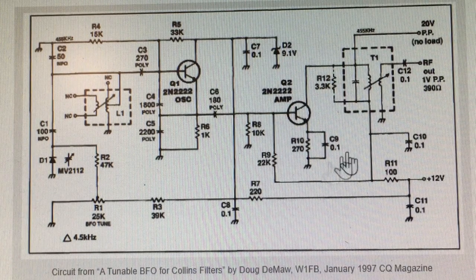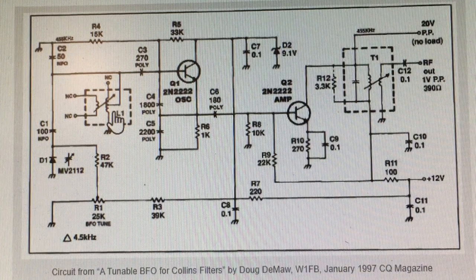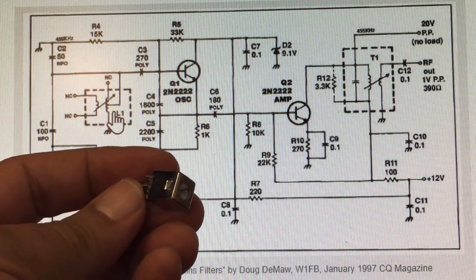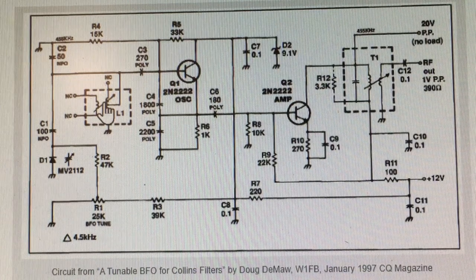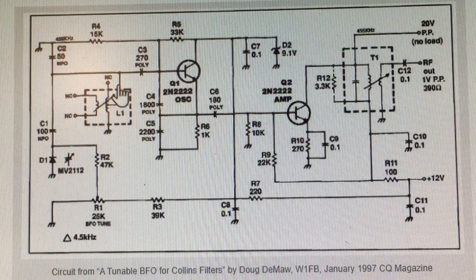The circuit has just an amplifier buffer, so it's actually quite simple. This is the actual oscillator, and he uses one of these IF cores — this sort of thing. He uses the third IF one, which I got from Mouser. I'll give you the links in the description. But this is by no means a complete project, so bear with me. What this does is basically use one of those cores as the adjustable inductor — the whole point of this is to experiment.